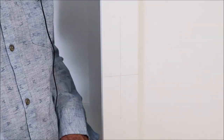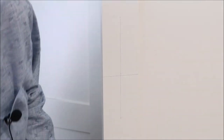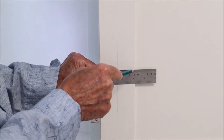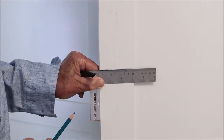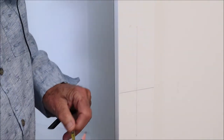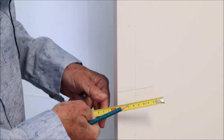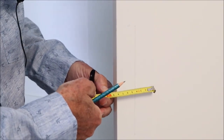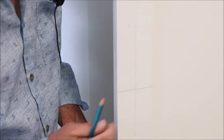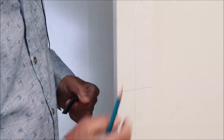In this case we've decided to put the door handle in the middle of this batten on the door, and halfway between top and bottom. So the first thing we do is find the midway point on the door, then with a square off the edge of the door we mark that level. The batten width is 8, so I need to draw a line at 4 and extend it a little way past the middle, because when I mark my template I want this line to show up on either end of the template.